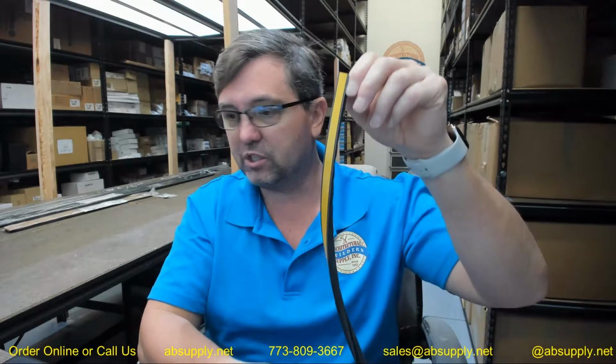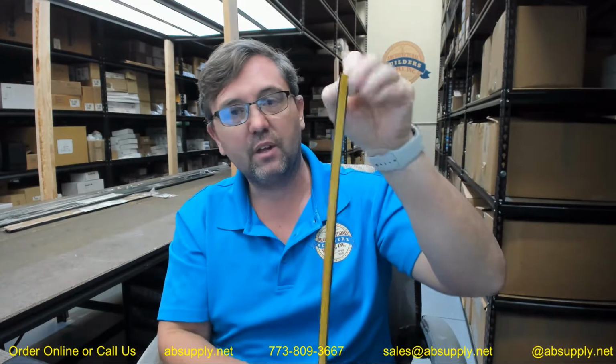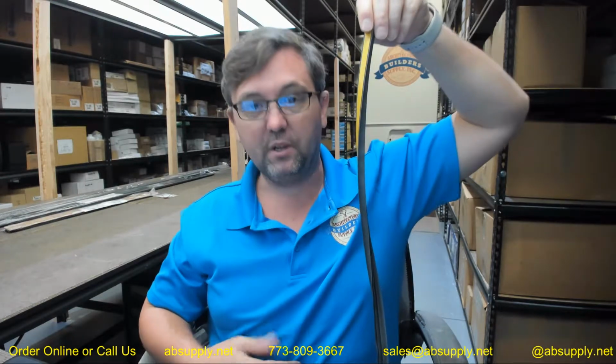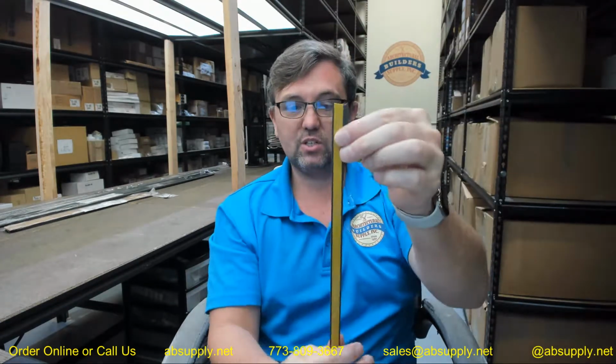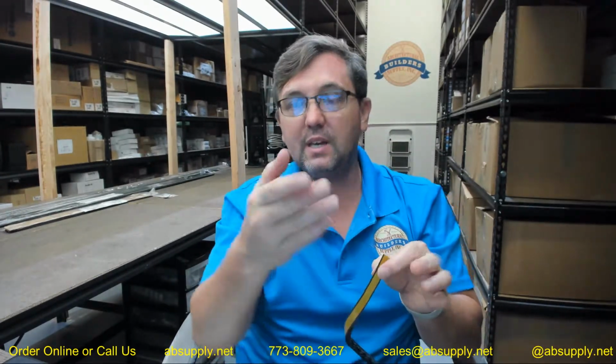When you're applying the material, they're going to say somewhere in here, they do, remove approximately 24 inches of backing. I like to work with a shorter length because when I'm working with a longer length, I have not only the possibility of bumping the material onto the frame, but I don't want to pull it taut. I find that using a shorter length, and because this is straight, you're going to see real easily if you're going down straight, and plus the frame's got nothing but straight lines on it, so it'll be easy to apply the material. Peel that off, continue to put it on straight, as much perpendicular pressure as possible.